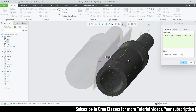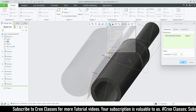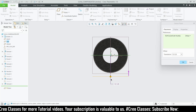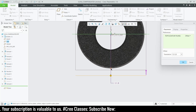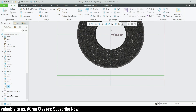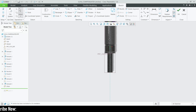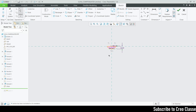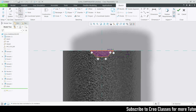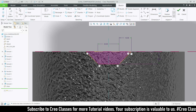The next thing is a hole feature. Create a plane — the specific value isn't critical, but it should be positioned higher than the previous reference point for creating the circular profile. After creating the plane, go to sketch on that plane. The sketch will be a line — from the midline, draw a straight line. The dimensions are hidden with black color, so let me show them.